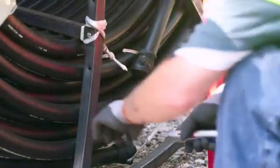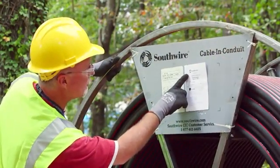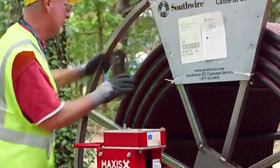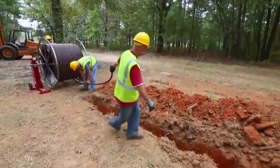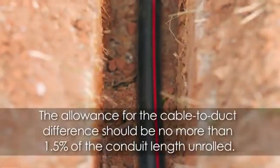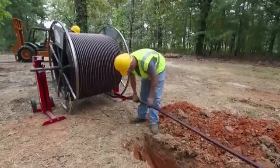In preparation to install Simple Cable and Conduit, the installer must first disconnect the cable at both ends. On one of the reel flanges, there is a placard warning the installer that there is a difference in duct and cable length. This length difference develops as you unroll the conduit off the reel, resulting in the conduit becoming longer than the cable inside. The allowance for the cable-to-duct difference should be no more than 1.5 percent of the conduit length unrolled.